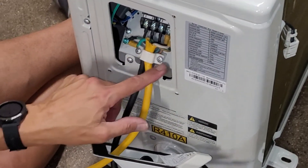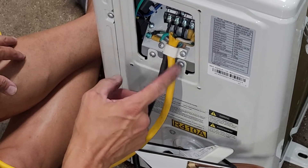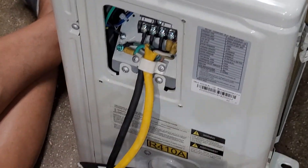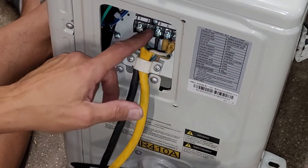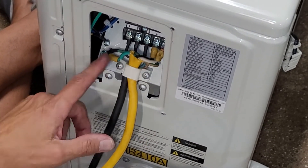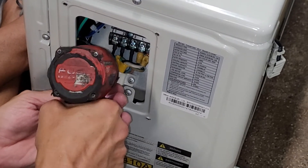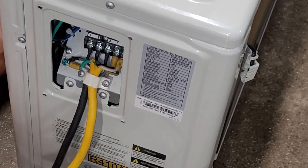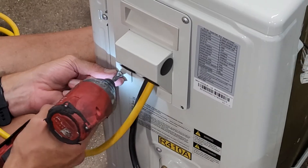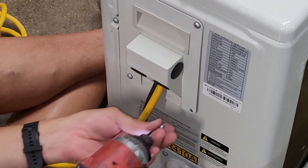The last step is putting this mounting flange. For this unit, it helps to have the control wires a little bit to the left of the power wires. So everything done here: one, two, three — black, blue, brown — line and neutral. Both the grounds are going to this green screw. Tighten this up all the way. Then we're just going to put this cover back on the same way it came off. This is just finalizing the plate, and now everything is quite tidy indeed.